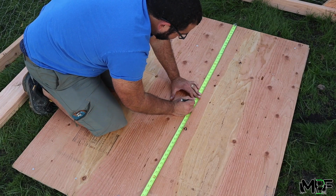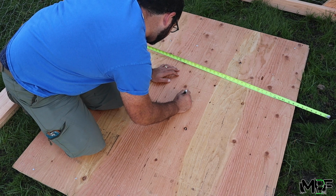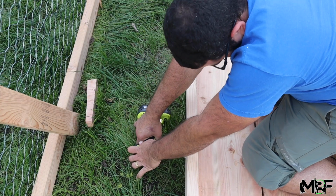After that, I attached two 2x6 boards to the sides of this rectangle, which will be the legs holding up the entire target. I positioned them so that the center of this target would be 63 inches above the ground, which is the regulation placement.